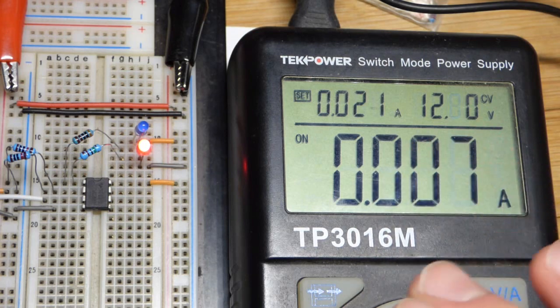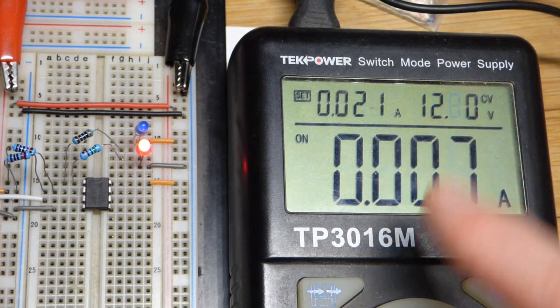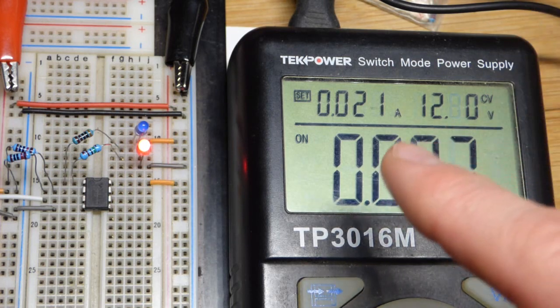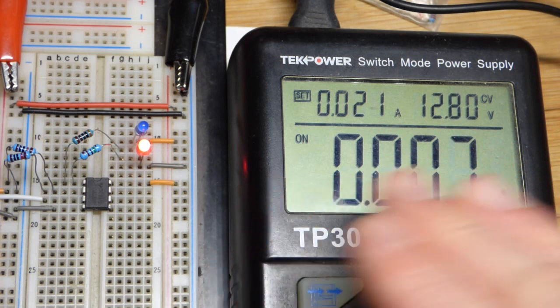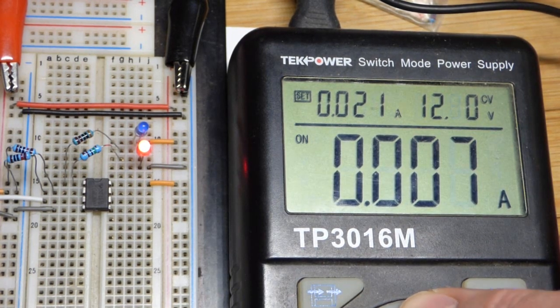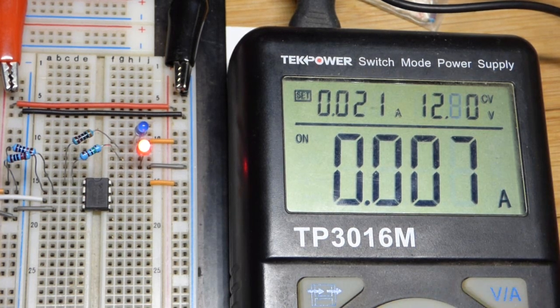And also it has a pretty flat voltage. So even though it kind of looks like we have a wide range going up to 13.6, it rapidly drops to close to 12.8 and hovers at 12.8 for a long time before it rapidly drops to 12 and then down to like 10 if you want to 100% discharge it. So the vast majority of the time, if you have a lithium iron phosphate battery, your voltage is going to be in the range of about 12.8. Hopefully that makes sense.